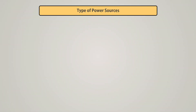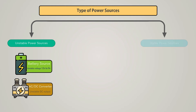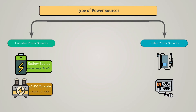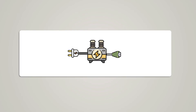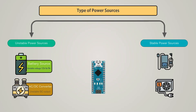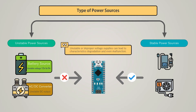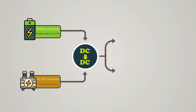So far we have discussed different types of power sources, but we can divide them into two more sections. One is unstable power sources such as batteries and simple AC to DC converters. The other is stable power sources like adapters and SMPS. In the case of an unstable power source, the voltage is constantly changing — as the battery discharges, its voltage continues to decrease. A simple AC to DC converter consisting of a transformer and a full bridge rectifier also shows output voltage fluctuation. We cannot provide power to a microcontroller from an unstable power source because it may not work properly. This is why we have to convert unstable power sources to stable ones, for which we use a DC to DC regulator.